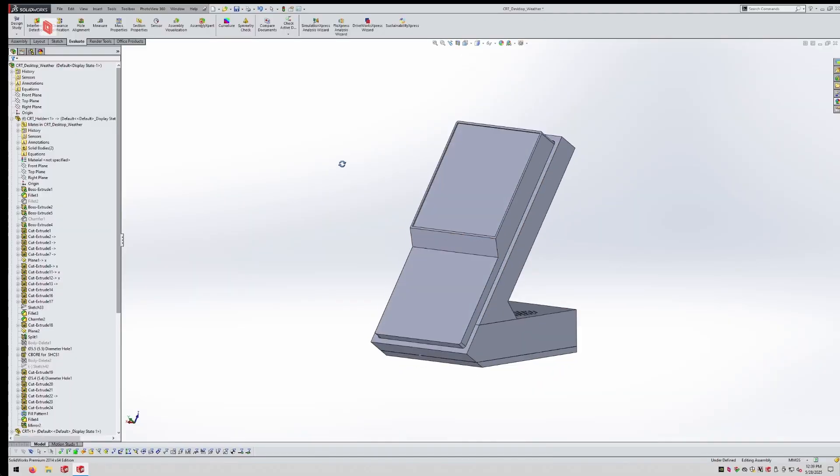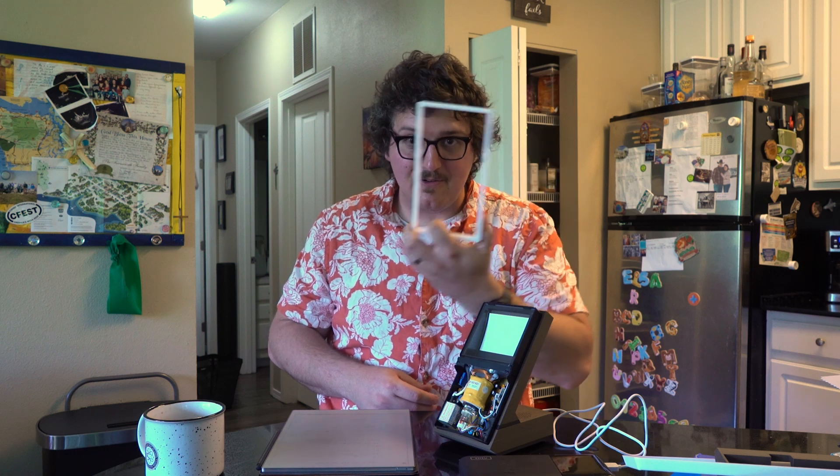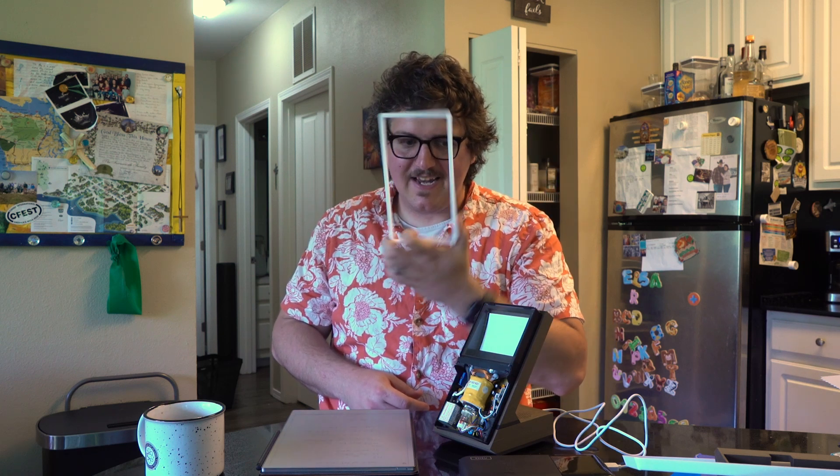The enclosure was designed around the CRT. My calipers got the width, but not the full length, so I had to switch to a ruler which isn't super accurate. What I ended up doing was 3D printing a little guide frame to tell me where I was off in my dimensions. The first guide frame didn't fit, and I also got the width wrong — which is ironic since my calipers could handle that. It was only a 5 to 10 minute print, and I was able to find my issues before committing to a large print.